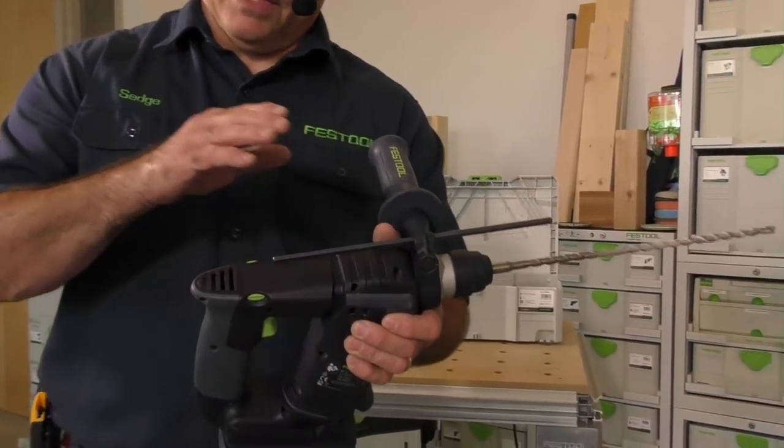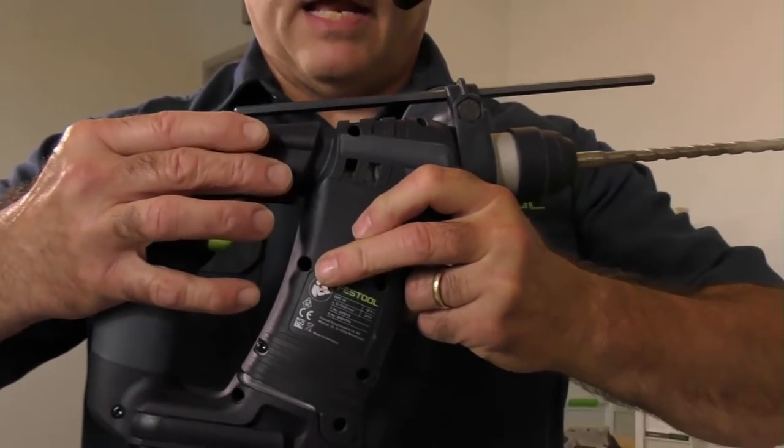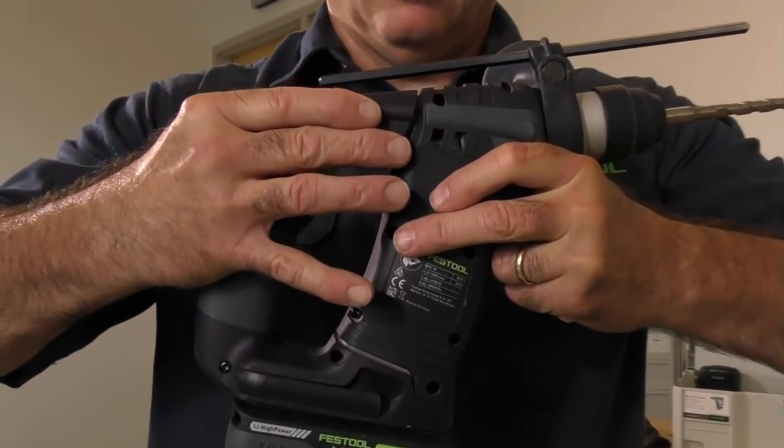Now, somebody asked me after we did that post, what's the difference between a rotary hammer and the PDC, the BHC and PDC? That's our hammer drill. If you were choosing a drill for wood, concrete, and steel, I would probably point you in the direction of the PDC, okay? A hammer drill, yes, is a lot louder. It's a multi-use drill, whereas if you're drilling strictly in concrete all day long, this is a lot faster, and a big call out for this is you'll see this part between here and here on the rotary hammer. Check this out. That is called vibration stop, and that little buffer, if you're drilling into concrete all day long, will let you drill more holes, okay?